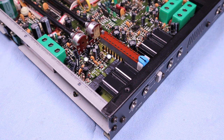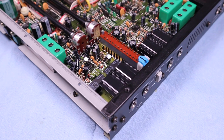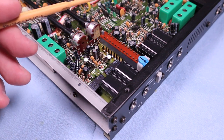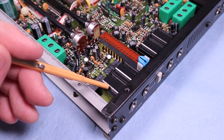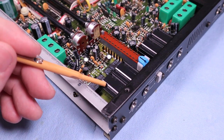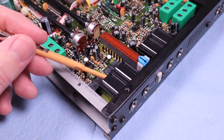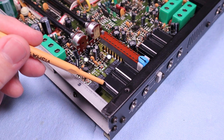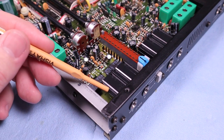So as you saw there, this thing is pretty much fixed at this point. Putting those new relays in there really solved most of the trouble with this thing. There were intermittent contacts in the jacks which were also affecting it quite a bit. Before I even started this video, I'd actually just sprayed a ton of Deoxit into these jacks, and that seems to have actually done a lot to make them better — because I can't really get them to cut out anymore right now. So generally this unit is fixed.